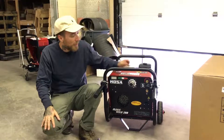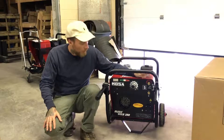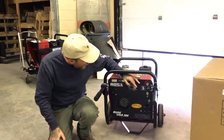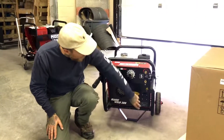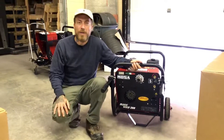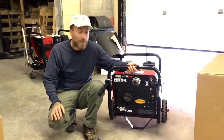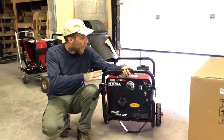A little bit about this machine — this is a 200 amp engine-driven stick welding machine. You can see your controls for amperage are right here, there are your terminals where you plug in, and that's about it, it's very simple. Down here you have 110 volt receptacles so you can plug in your trouble light, your radio, your corded or cordless drill, or whatever tools you need — you can power them off there.